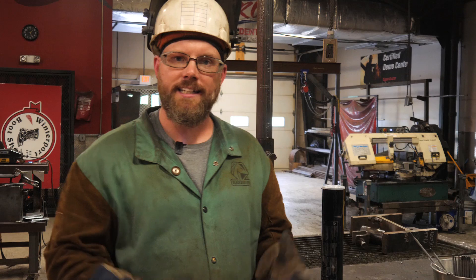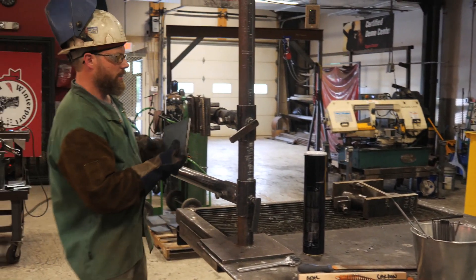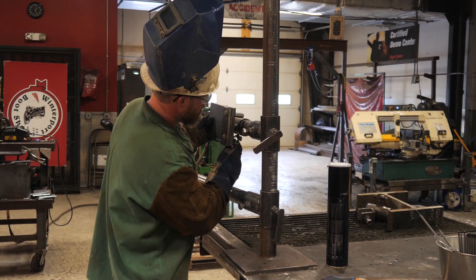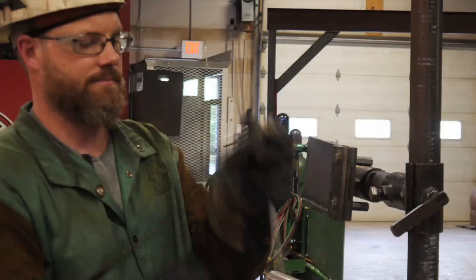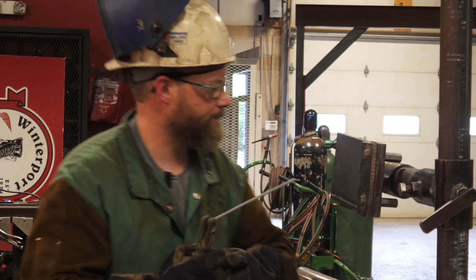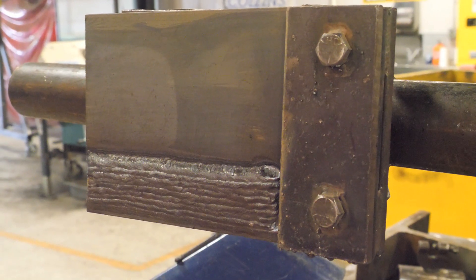Now we've finished up with some flat pad welding and we're going to move into the next position — horizontal. I have all the students lay their first bead for out-of-position welding in the flat position so they can work on it out of position. We'll take this plate to our fixtures, stick it in, and tighten it up. We want to pick a height that is comfortable for the welder — this is all adjustable, not too low and not too high. For 2G, or horizontal, we keep a drag travel angle and a 5 to 10 degree work angle aimed uphill to prevent undercut and sagging of the weld pool. Horizontal allows for a faster travel speed so you don't get cold laps in your welds due to gravity.